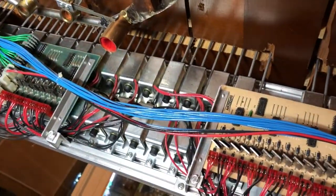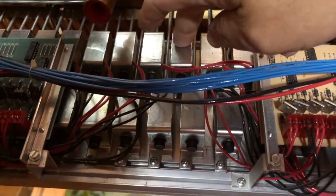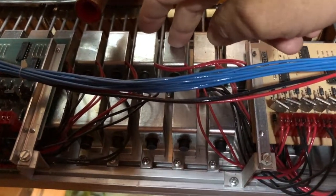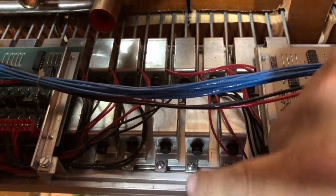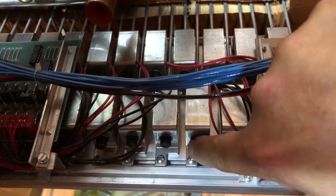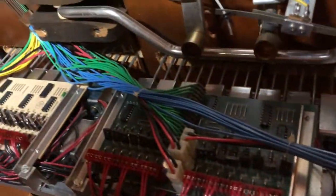All right, so here we are under the piano. And I made a little mistake earlier when I called these servos, they're not servos, they are solenoids. Servos move things back and forth, while solenoids use an electromagnetic field to lift these plungers and hit the piano. So this kit that we have, let me move this stuff out of the way and move this light down.